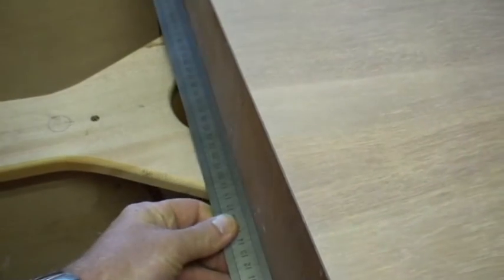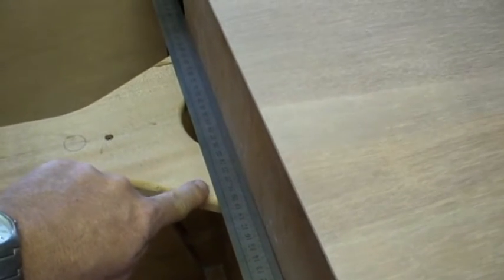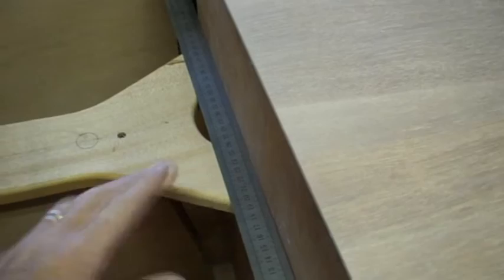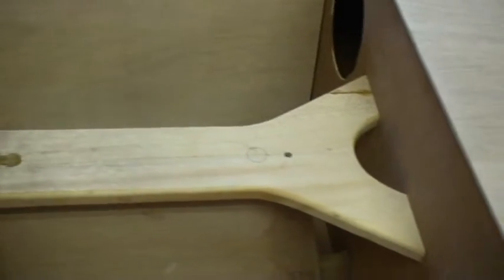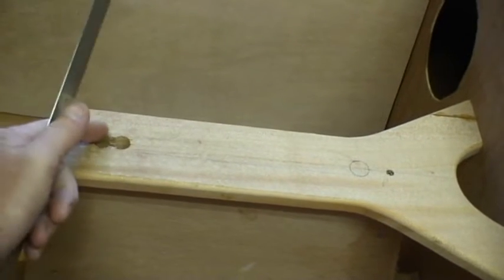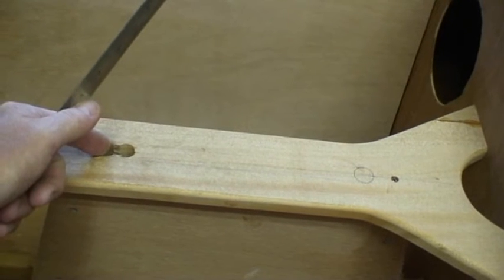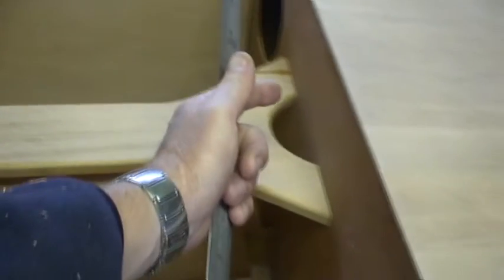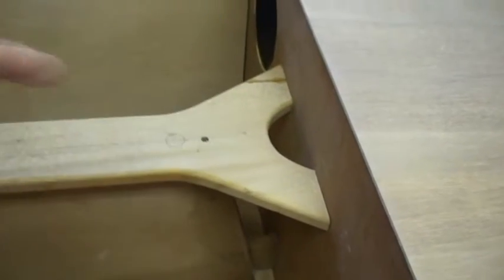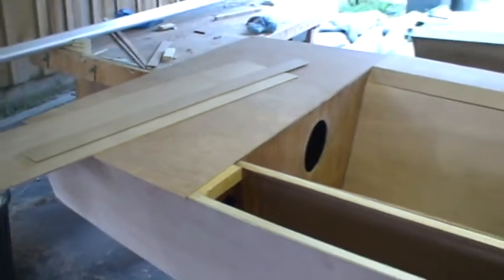With the center case top slot moved back that known distance from where we want it, it's then a simple matter of laying the ruler over the front of the center case top, hard up against this bulkhead, and scribing across the back end here. That means when we shift the whole lot forward this known amount — the distance of the ruler — this piece here is going to line up with the front side of that post and will lie across the bulkhead.